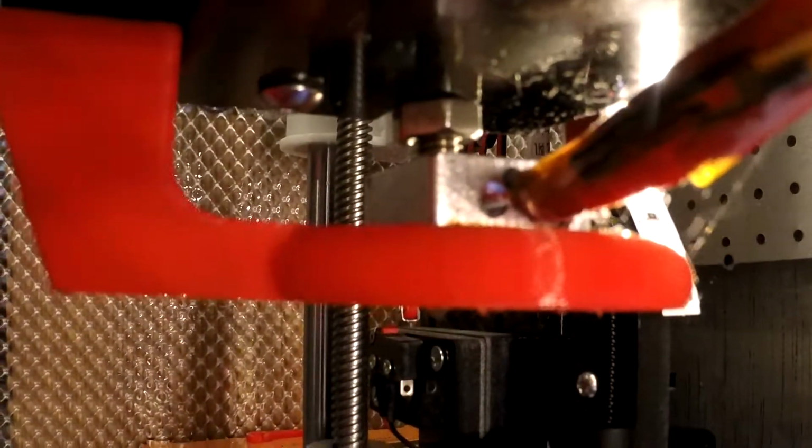That's just a spade connector. And then I utilize both pins because you have 2 negatives, 2 positives, and then the 2 in the middle are for your signal wires that run up to your extruder. Okay, so just do what I did right here. It's a very simple fix, and I've never had a problem with anything getting hot here, nothing burning or anything.